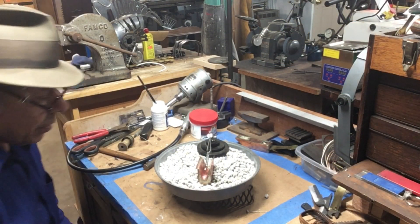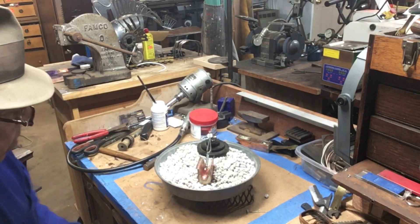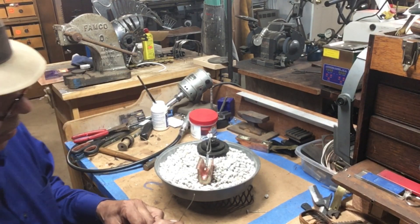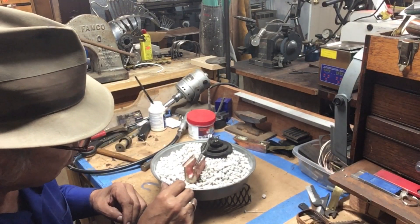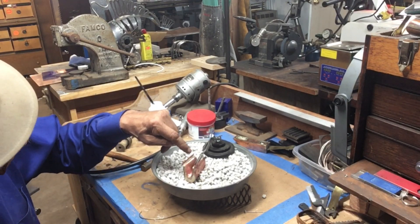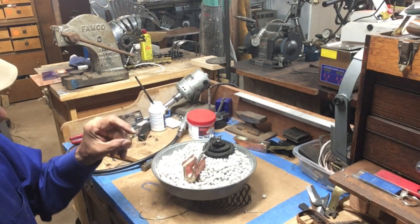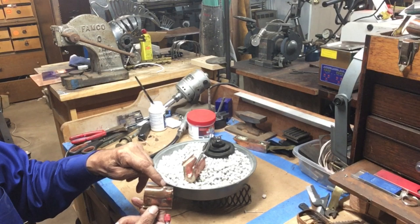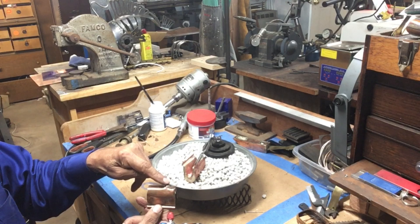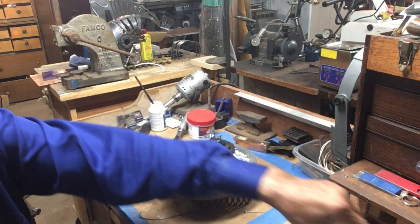We're going to solder on the little Venturi port, jet port. I have to be careful that the tube is inside of that little bump and is not below it or flush up against the top of it on the inside — it needs that gap. Just a little gap in there for that steam.